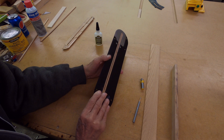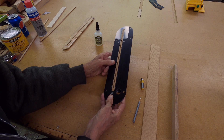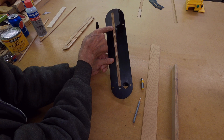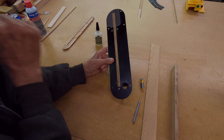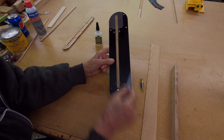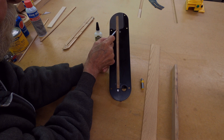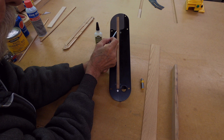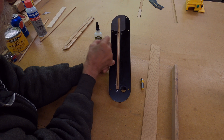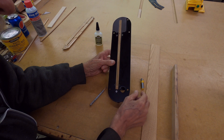When the glue was all dry and hard, I put it in the table saw and cut the slot — with the blade clear up, that's as far as it cuts. This last little bit I marked off so I can put it in either a jigsaw or the scroll saw to cut the rest of the way out for the riving knife.